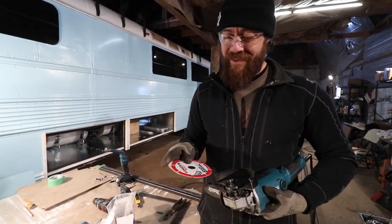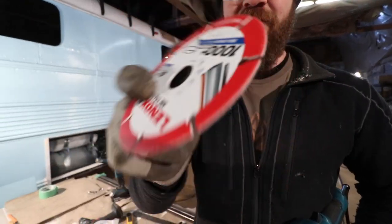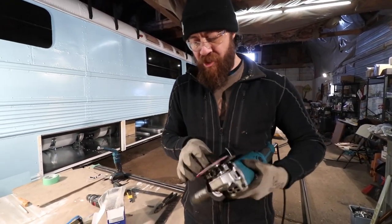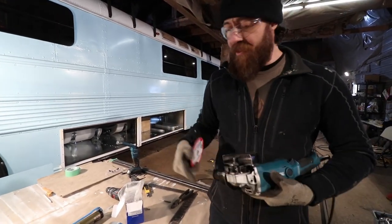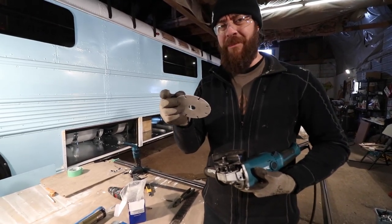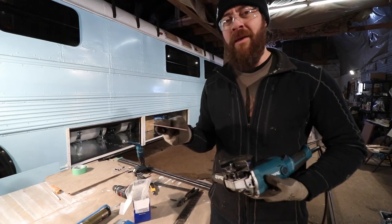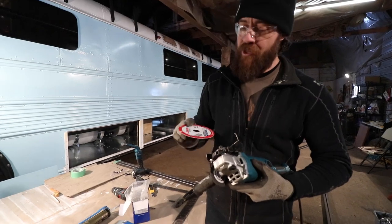It kind of looks like a piece of cardboard, but it's got diamonds infused into the edge and it's got a super thin kerf cut — and it's metal so it stays the same size the entire time, it doesn't change sizes on you. The last one had a really thick kerf cut so it grabbed the metal really fast, while this one cuts through a lot better and doesn't grab as much. A huge difference.